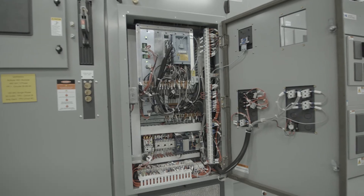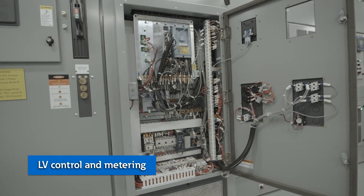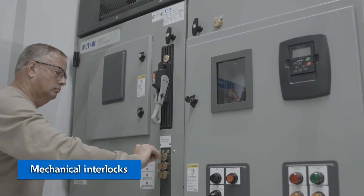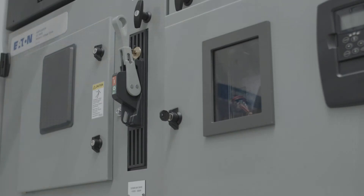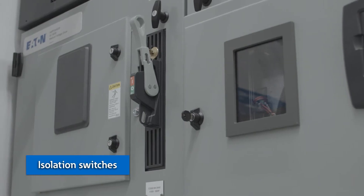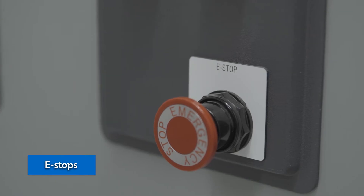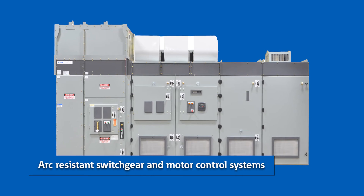Safety. Think about personnel interacting or maintaining this medium voltage equipment. There are various ways to protect them: having low voltage compartments that house control and meter wiring separate from medium voltage compartments; having mechanical means to prevent entry into energized compartments, such as keyed cabinet doors or card keys; having isolation switches that disconnect line power to each compartment; adding e-stops to each compartment or motor circuit; and finally, consider arc-resistant gear to protect from arc flash hazards.